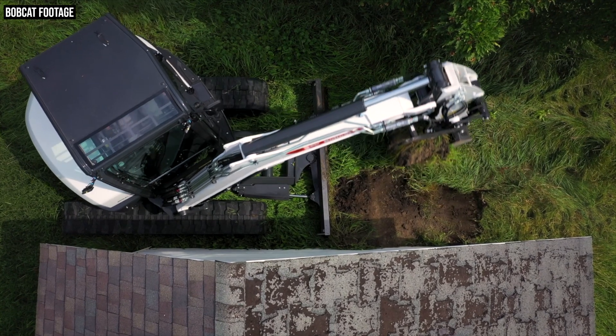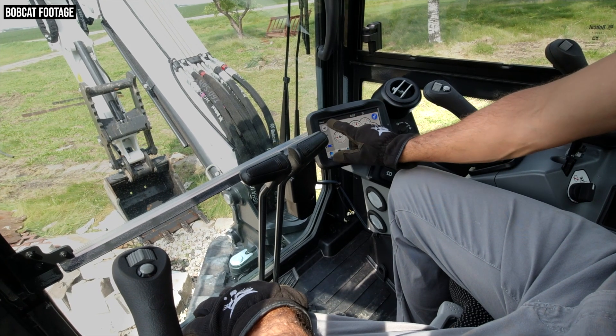There are some optional pieces of equipment to know about with this cab. While a 5-inch screen comes standard, you can also opt for a 7-inch touch display. Bobcat notes that the standard 5-inch display with a jog shuttle is itself an upgrade over their previous deluxe display — it has a lot of capabilities, including operator codes, tracking of operator hours, fuel efficiency, and idle hours. If an operator throws a code, you know who did it, when, and whether they kept operating when they shouldn't have.